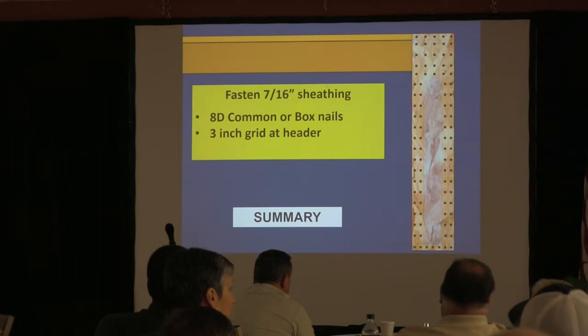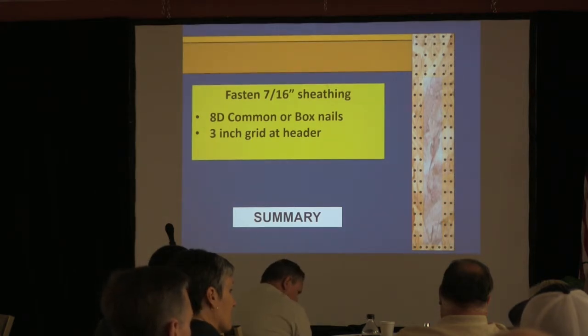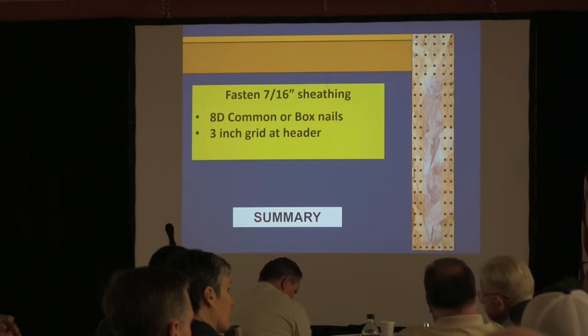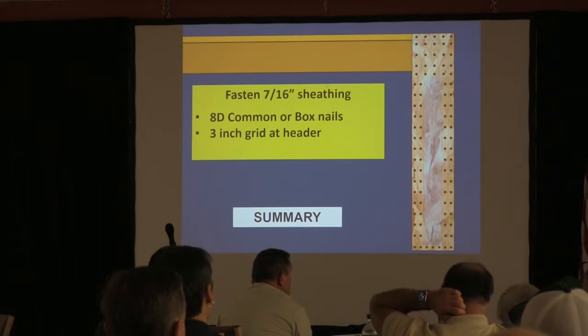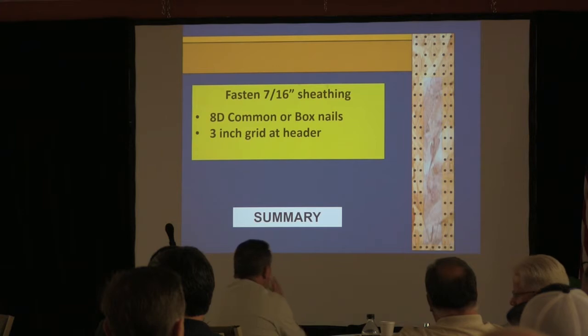Yes, sir. It might be helpful for some of the new guys to understand that after Katrina and Ivan, they did studies on all the houses where the hurricanes ripped them apart, and they learned that the first thing to get compromised was the garage. Oh, yeah. Because the openings that we're talking about here would rack, and the lightweight garage doors would blow out, and all the wind would get into the garage and then take the rest of the house with it. So this was the weak link in the chain, which is why there was so much focus in the new codes to beef it up. There's a lot of great pictures out there of these failed garages. And it just leaned over. That storm also changed wind bracing wall panels. Oh, yeah.